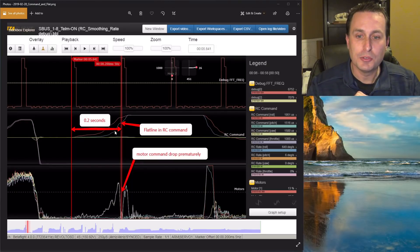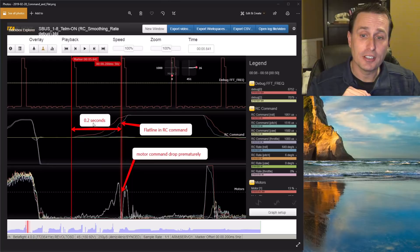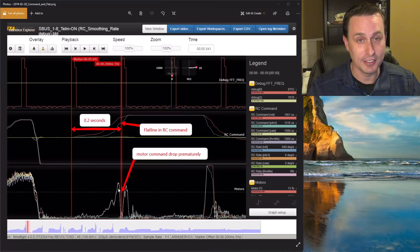With the smoothed RC signal, you can see a packet jumping up — going from 6-millisecond frames up to around a 30-millisecond frame — occurring every 200 milliseconds or 0.2 seconds. It's getting smoothed out somewhat, but even with that, you can see motor inconsistency: it pushes the motors to ramp up to full rate of rotation, then the command dies down to nothing, and then ramps back up again.